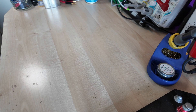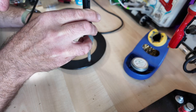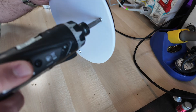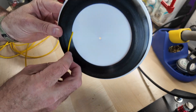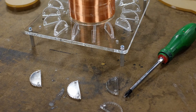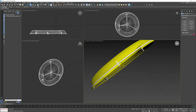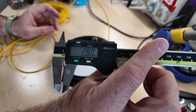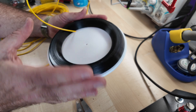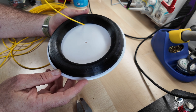So what we need to start with: a half-donut-shaped thing, a base for it, wire, inserts, dichloromethane, three holes. I did some lateral blue-sky thinking outside of the box and calculated that if I could find some 18-gauge wire with exactly the right diameter of insulation — exactly 2.8 millimeters — and wrap that onto a simple half-donut shape, then everything would naturally fall into place, using the insulation of the wire as the spacer itself. The downside is I don't know if it's going to work until the end. I'm hopeful, although I haven't double-checked. I'm not really a double-checker.